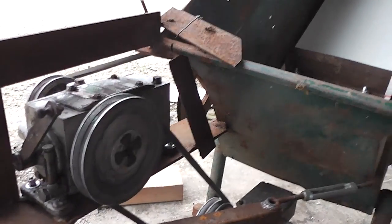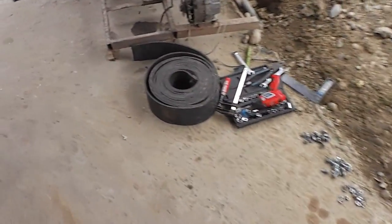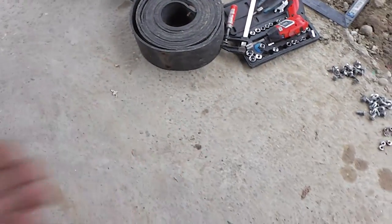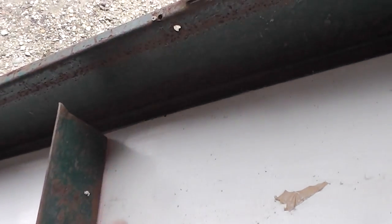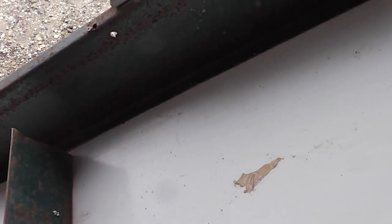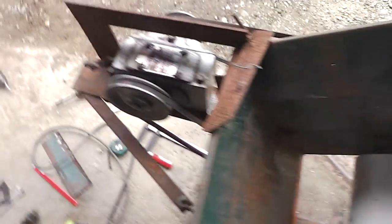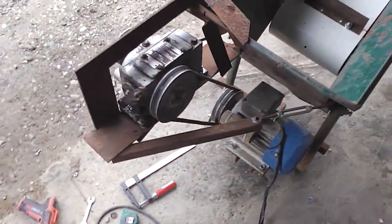Finally, it is ready. We transport the corn into our storage boxes. The previous transporter had this small belt, so all the corn got stuck between the blades and the transport frame. This time the corn cannot go underneath all these blades — they will just keep pushing the corn. That is it for now — the rebuild of the old transporter with the bigger belt, and it works.